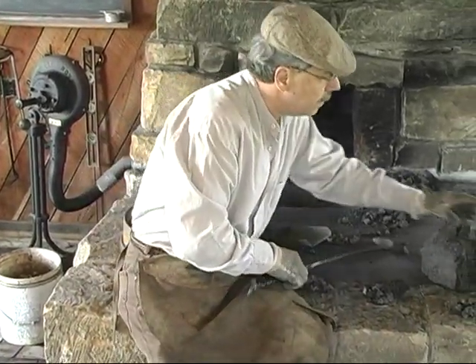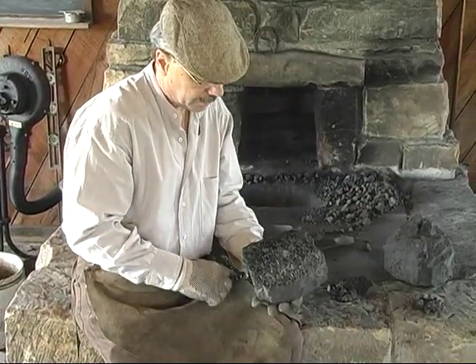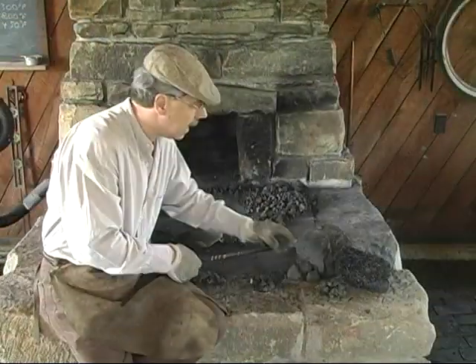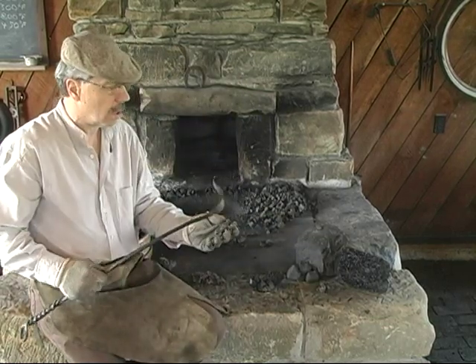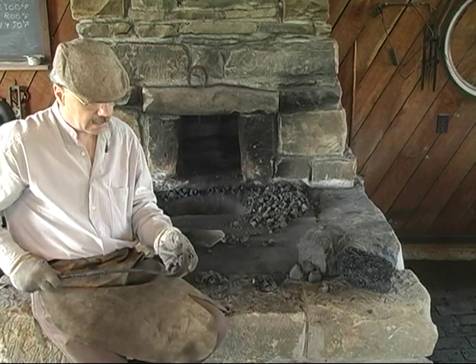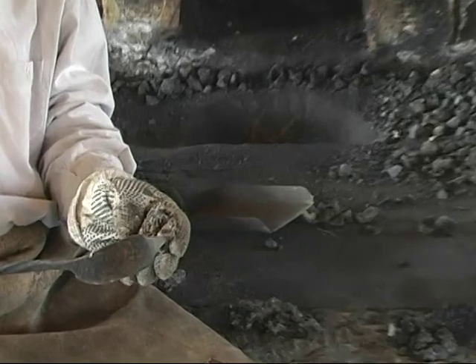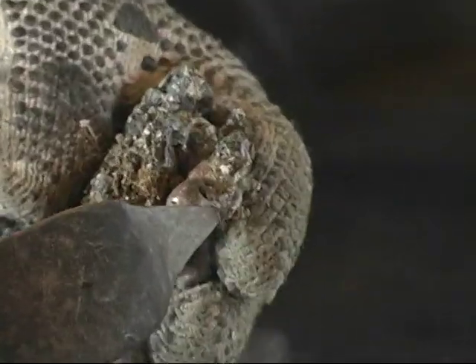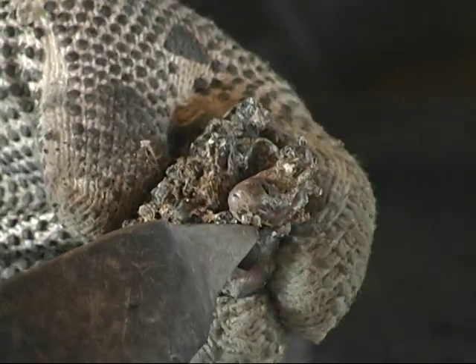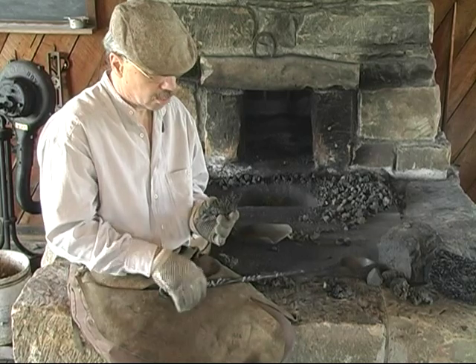First off, I've got some pieces of coal in lump form — this is the way it comes out of the earth. We dug out a couple of what we are calling clinkers. It has a metallic sound. You'll see these big round pieces — they're impurities that have solidified where the air blast comes in. Now, what we're trying to produce is this product, which is coke.